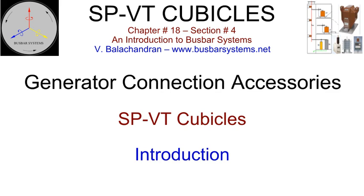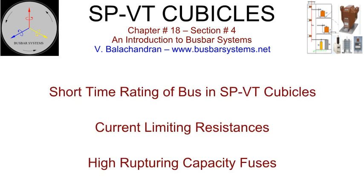Its enclosure is connected to the isolated phase bus tap-off bus enclosure through a rubber bellow to electrically isolate the cubicle. The conductor is connected to the isolated phase bus tap-off conductor through a flexible laminate. The isolated phase bus tap-off conductor is connected to the cubicle incoming through a seal-off bushing mounted on the cubicle.